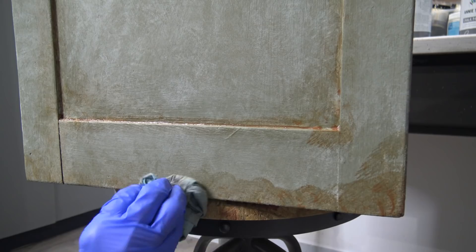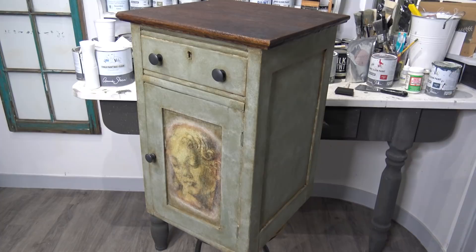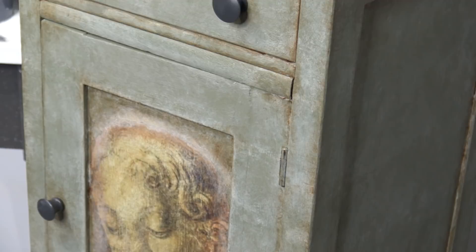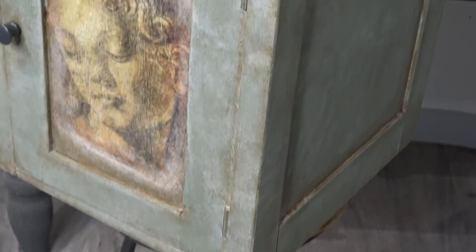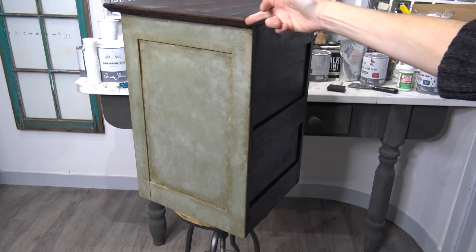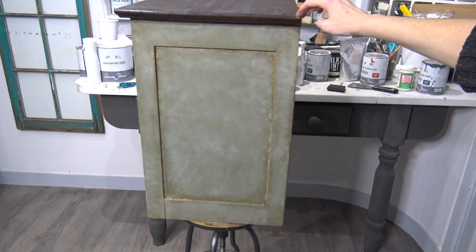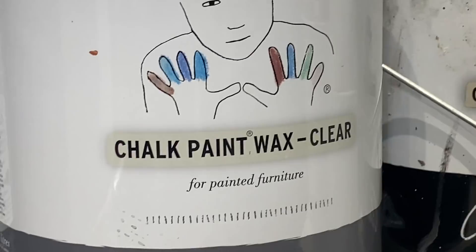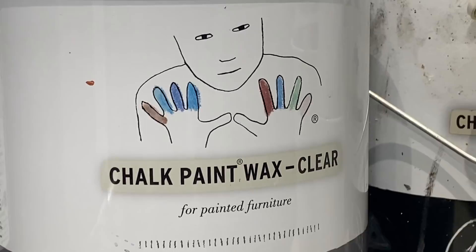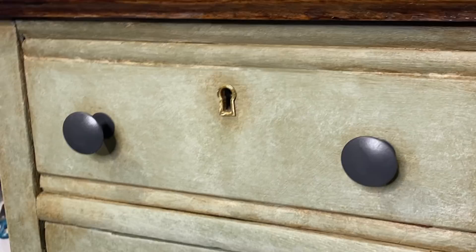Remember from the beginning steps — you can always apply clear glaze first. So as you're playing around with any style or color glaze, you know how to correct it and have control over where and how you want that glaze to look. It's definitely a great little tip to know. Really important: glaze does not seal your chalk paint projects, so I still need to apply a clear wax to seal and protect the chalk paint finish. You can use a clear wax or even a lacquer finish — it really depends on the intended use of the piece. The wax has now moistened and enriched the colors and made it all come to life.